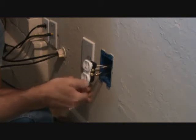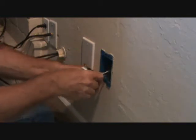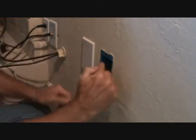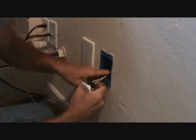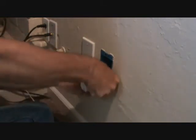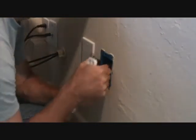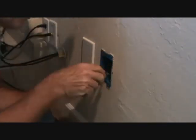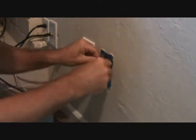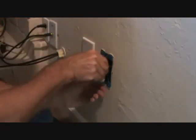If these wires were bigger and I had more room here, maybe I'd leave those in, but I like to take these out. Now I can kind of flop those wires down, hold my finger down there, push up on here, and spaghetti it kind of like an S. It's kind of tricky because these wires aren't any longer. I'll try to keep the bottom ones down and pull up on that so I've got a natural S going on as I push it in. I like to keep those screws out because the screws would hold it right there and keep me from pushing it all the way in.